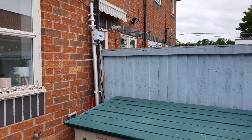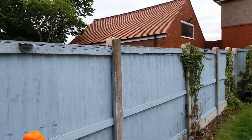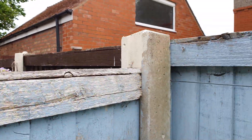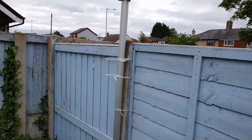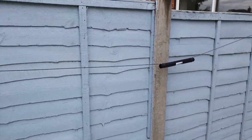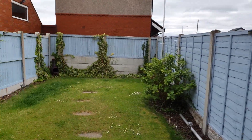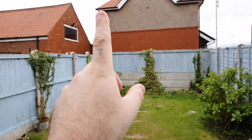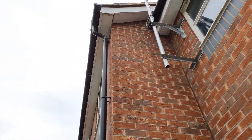Right, just a quick video showing how I set it up when I got the antenna. It's just on a metal pole there - not ideal, but just something to support it. The wire goes basically all the way across the fence and I've hooked it round this fence post, going over the back of it, then coming diagonally across so I miss that steel there so it's not going to affect the antenna too much. Here is the loading coil for 80, and then the 80-meter element just goes up to there. The plan is I've got a spider beam pole coming - I'm going to put that up at the back corner vertical, put the transformer at the bottom, go up as far as I can, and then mount it across with a decent distance away from the metalwork.